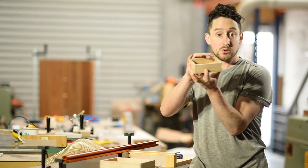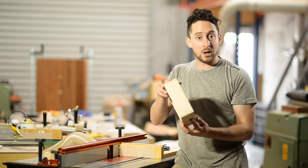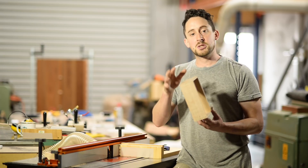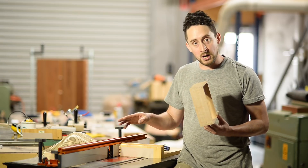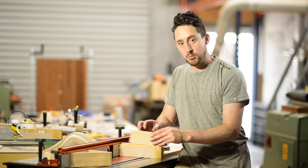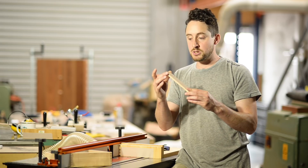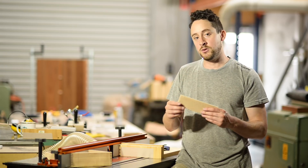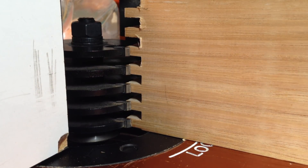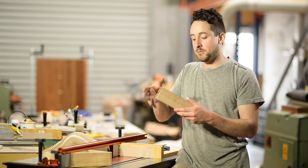This process is fine if you're creating a really shallow box or tray, but often you'll want something deeper than the bit will allow in one pass. The simplest way to think about it: the bit allows you to cut 40 mil in one pass. If you do one pass the correct way up and then flip it over and do the other pass upside down, you can get something up to 80 millimetres wide. If you really want to push it you can get up to about 100 millimetres — you do your first pass, raise the bit up to its full height (about an additional centimeter in my case), do another pass, then flip it upside down, bring the bit down to its lowest point, raise it that additional centimeter, and that's how you get to about 100 millimetres wide.